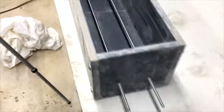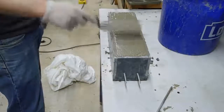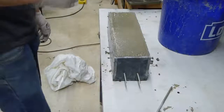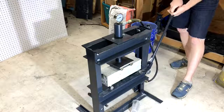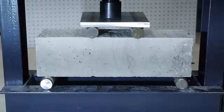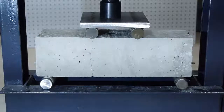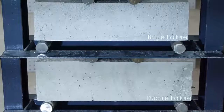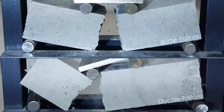I made a new beam with a couple of steel threaded rods cast into the lower portion of the concrete. These threads act just like the deformed ridges in normal rebar to create grip between the concrete and steel. Under the press, the first thing you notice is that this beam is much stronger than the previous one — we're already well above the force that failed the unreinforced sample. But the second thing you notice is that the failure happens a little bit slower, and you can easily see the crack forming and propagating before the beam fails.